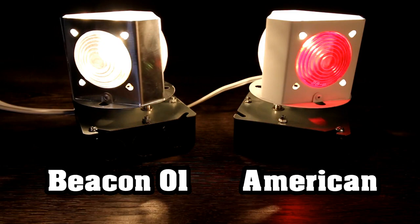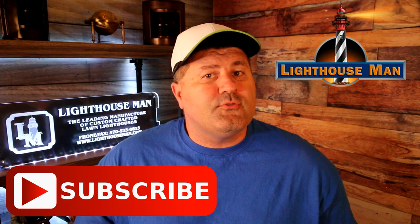Now, like any item that has moving parts, we highly recommend that you do some regular maintenance to keep your beacon up and running smoothly for several years. I recommend that you lubricate the nylon gears and motor shaft with a high quality lithium grease at least two times a year. This will keep the gears from dry rotting or breaking down. You can use WD-40, but since this is a liquid lubricant, I recommend applying it at least four to five times a year. The better you take care of this beacon, the longer it's going to last.